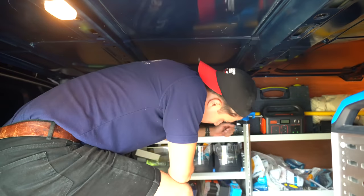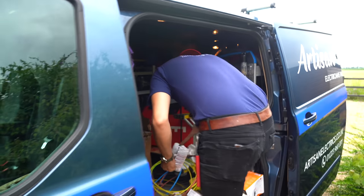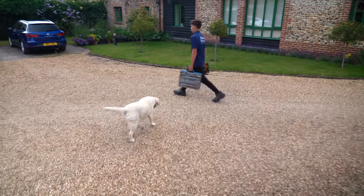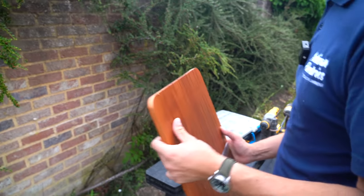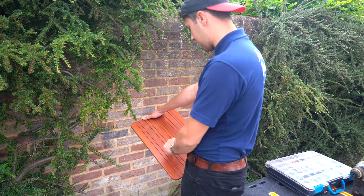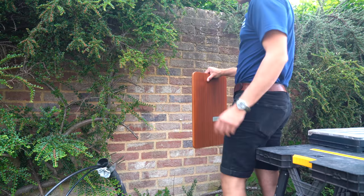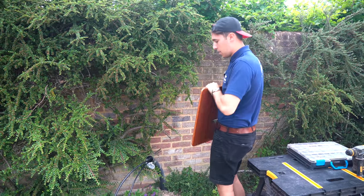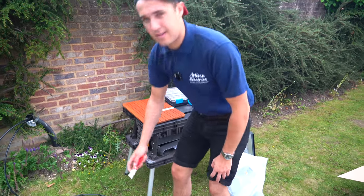Is it raining? Not loads to do outside, not a big deal. They've got a lovely walnut finish on this Anderson — just tasty. They're not my favourite chargers ever, but in terms of aesthetics right now I think they're just not being beaten. That's going to be mounted just there — I'll probably clip the cables along underneath and straight up and in. We've had to use the hardwired CT because we can't really rely on an internet connection from that far away without using boosters.